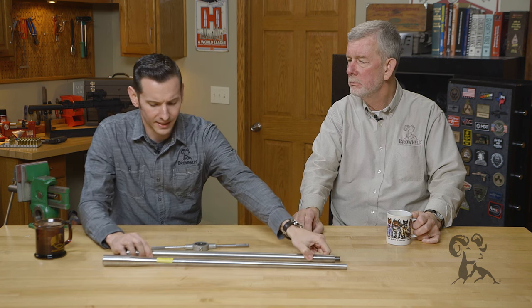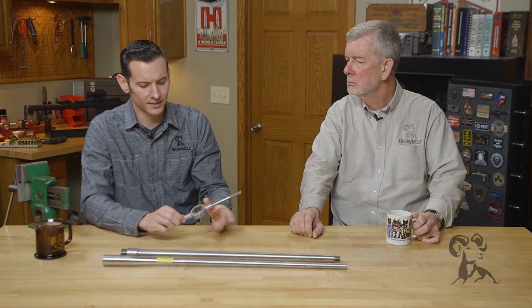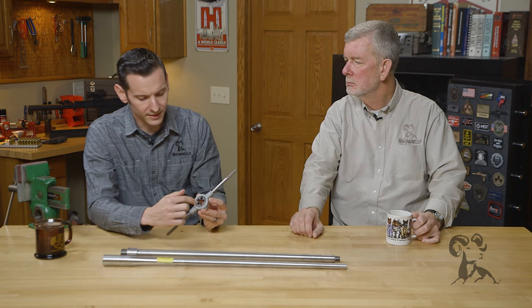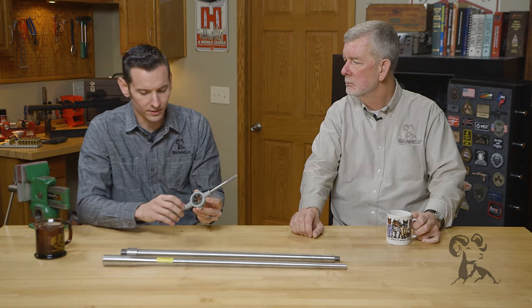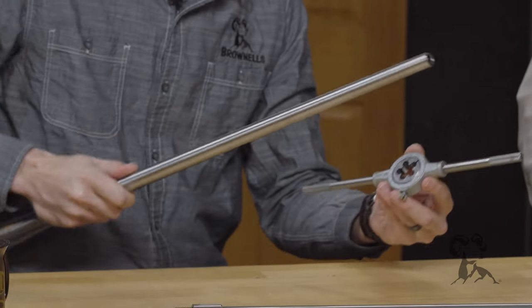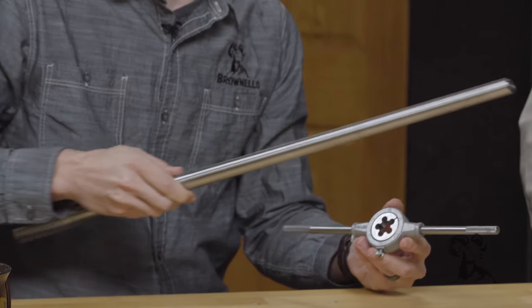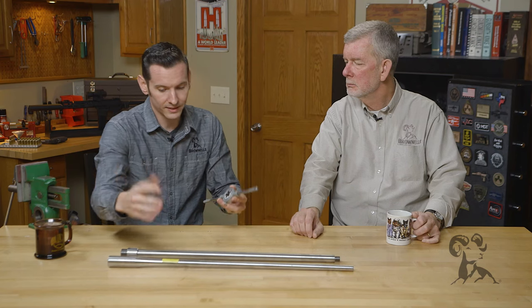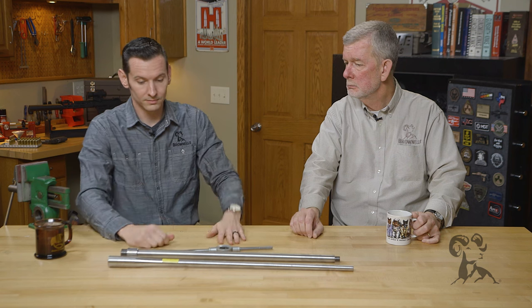You can't cut that shoulder with a die — the die is only going to cut the threads. When we're talking about the die, this is what we're talking about here: this die inside of a die wrench. It has these interrupted threads on it that you thread onto the end of a blank muzzle like this one, and it'll cut the threads on it.